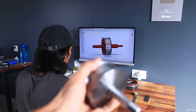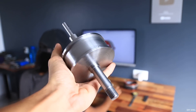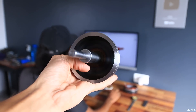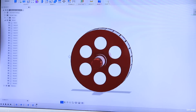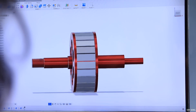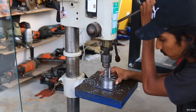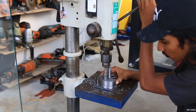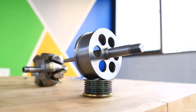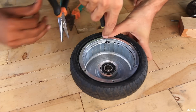Once we finalized the rotor design, we outsourced the whole machining process — and here it is, a job well done. We have a 17mm shaft to which the faceplate and the drum is welded. We have 3mm collars on either end of the drum that will later help us align the magnets vertically. To further cut down weight, we drilled 6 holes on the rotor faceplate that allow air to flow across and keep everything cooler. We then salvaged the magnets from the hub — we needed 24 of them.